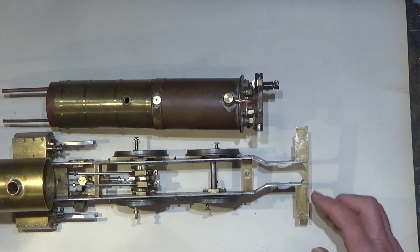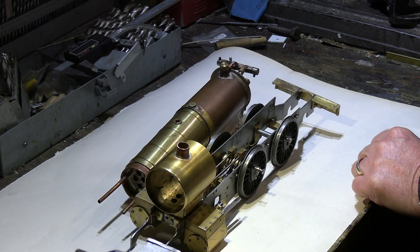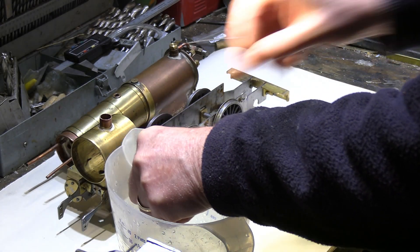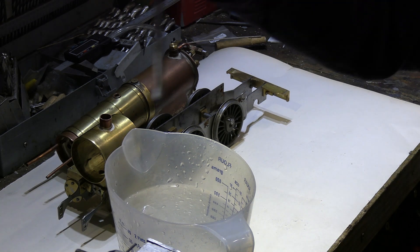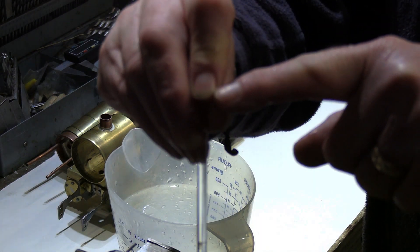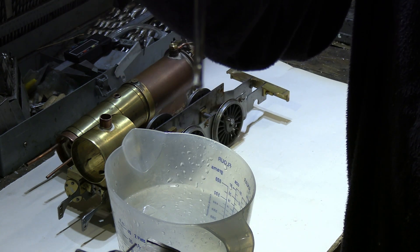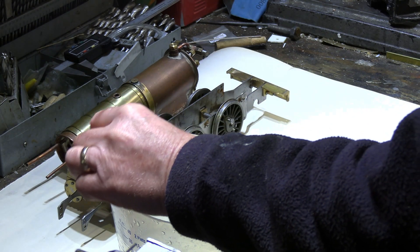The next major thing to do — the last real components to make — is for the burner, and it uses a very simple principle. I'll just show you how that works. The principle for firing these boilers works on air pressure. I've basically got a little column of glass filled with water with my finger over it. The water can't come out because it's all cancelled out by air pressure. Now if I take my finger off the top, the water comes out — and that's the principle of the burner arrangement we're going to use. It's called a chicken feed.